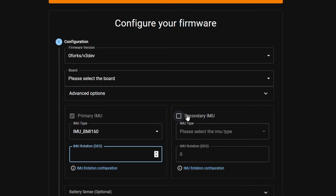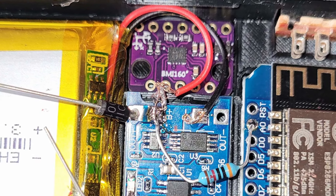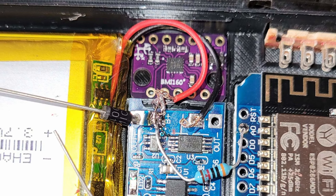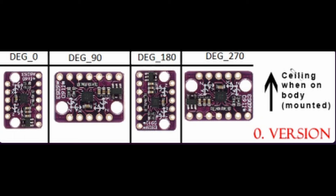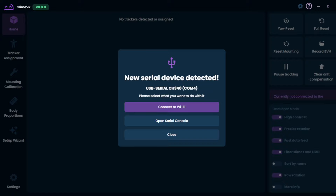But what do I mean by the proper degrees of rotation? Well, following this schematic right here and looking at the way our IMU is placed inside of our case, we can input the proper number for the ceiling of our IMU. Keep in mind, this number may be different depending on where the tracker's mounted on your body. Think of the ceiling as the direction the IMU is facing towards the headset. Now that your firmware's flashed, it's time to calibrate the IMUs. Open your SlimeVR Server, plug in your tracker, and then it should prompt you to connect to the Wi-Fi.